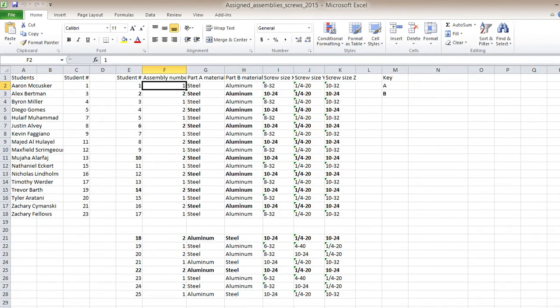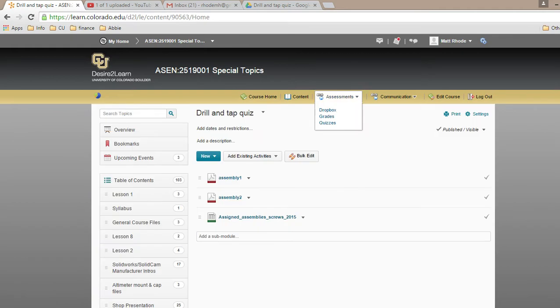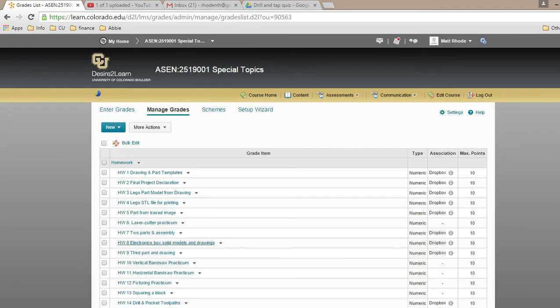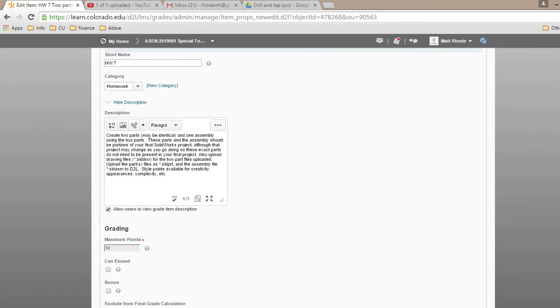So remember, I want you to go through that equation, calculate the spindle speed according to that equation, the material that you will use with the drill size, and then also the feed rate. I want you to write down what you actually used, and the feed rate's going to be approximate because we're not having fine control over that, just kind of what you thought you did. And then the amount of peck that you took off each time if you used a peck.